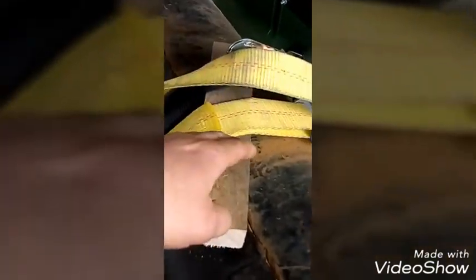This is how you fix a lawn roller. This one was full of water over this cold winter we just had — minus 25. It's split right on the weld, all the way down. Believe it or not, it was split open probably about that wide, and the metal here was humped way up. What I did was I took a hammer and just pounded it down, put these straps on it, and the key is to put a piece of wood over top of the welded seam.